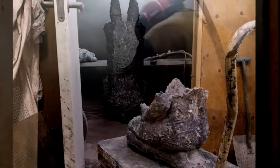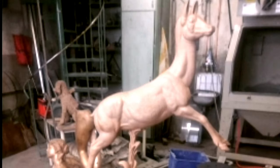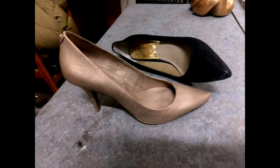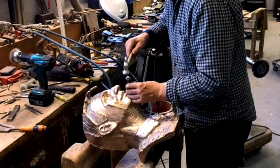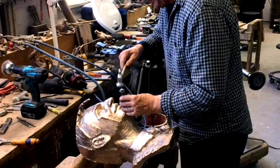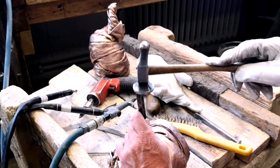When most of the ceramic or sand is removed, it is sandblasted. This cleans the bronze from ceramic residues and oxides that would otherwise shorten the lifespan of the chasing tools, and makes it easier to see any defects that occurred during the burnout or casting. After sandblasting, the bronze chasing begins — any surface defects from the cast or burnout are chased away using special chasing hammers, various chasing punches, and grinding tools.